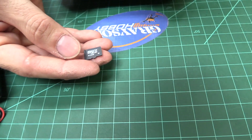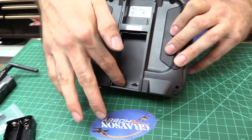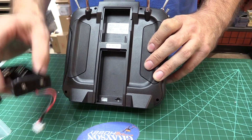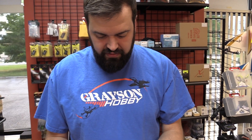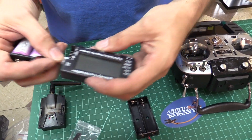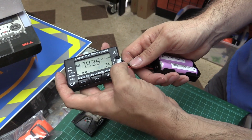This is a 512 megabyte SD card. You can use a two-cell LiPo battery if you have one, but it's got to fit the dimensions, which is a weird size, so you're probably better off doing the 18650. The nice thing about this battery bay is if you put it on a cell checker, it will read individual cells. The Jumper T16 does not have an onboard charger, so you can't plug USB into the T16 to charge your batteries — you do have to remove the batteries to charge.